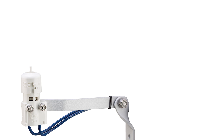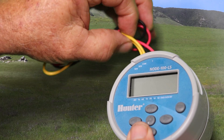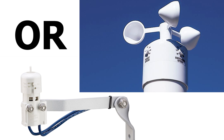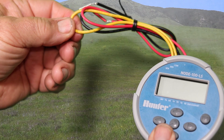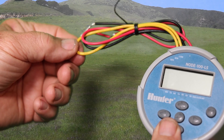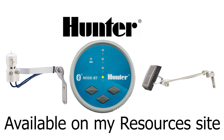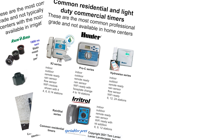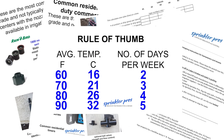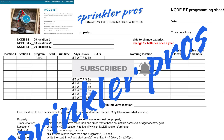The node is compatible with rain sensors and wind sensors — that's what the yellow wire is for. But with the node you can only have one or the other. To install it you simply cut this yellow wire in half and then splice the sensor onto those wires. All the items mentioned in this video are available on my resources site linked below, along with free downloads to help you with your irrigation system. Please like and subscribe to this channel and hit the bell to be notified of new videos.